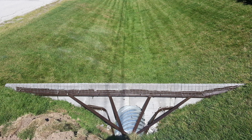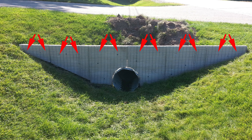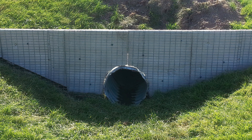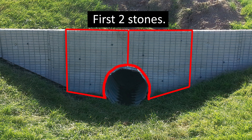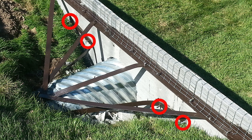Securing the stone facing. The three-inch angle iron rail supports the top of the wall and each stone is secured to this rail with two of these anchors. Position the anchors relatively close to the upper left and upper right sides of each stone. Do not over tighten. My first two stones on each wall were the ones surrounding the culvert and I then worked outwards from there. For the bottom of the stones adjacent to the culvert we used quarter-inch by two-inch metal strapping secured with the very same anchors.